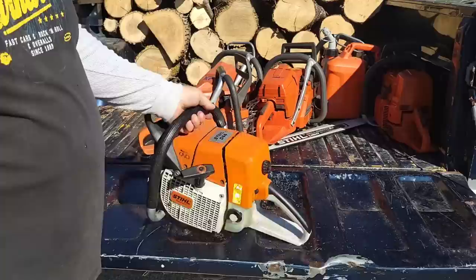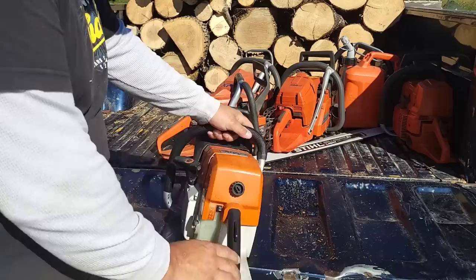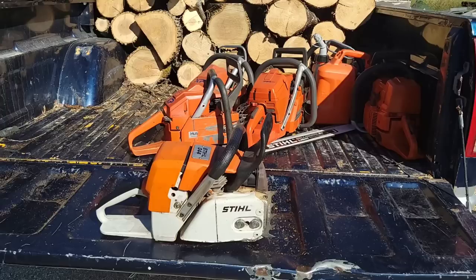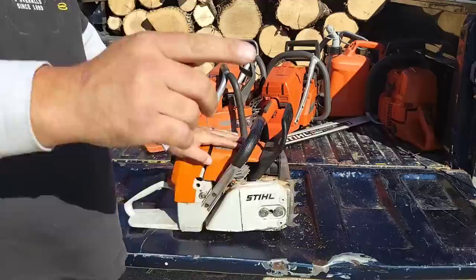You hear how rich it is? Not even pinning it. I'll probably have to go to Stihl one of these days and see how much a carburetor is. It has heated handles — Farmer Tech handle — and I've had it on the saw for about five years with the Farmer Tech fuel line. I've run ethanol fuel in it with zero problems with the fuel line. This saw got run constantly for years; it was the only bigger saw I had with a 24-inch bar and I cut nothing but oak with it. The 044 — I know why Stihl guys love these. They're good saws, they're light. I'd like to get this running so I can do a showdown: 372 versus 044.